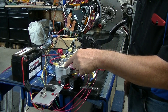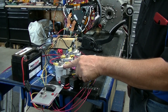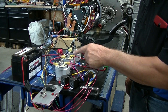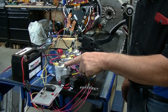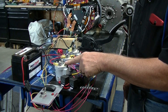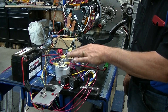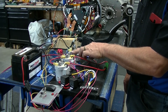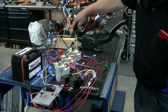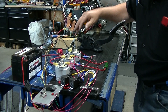Here's the setup. Three contactors. One contactor is a pre-charge contactor, which turns on before the main contactor and makes sure there's enough voltage in the system to run the motor so you don't hurt it. This is the pre-charge, this is the main contactor for the positive, and this is the main contactor for the negative. Those go over here — positive and negative — with just small wires on them right now since it's just a bench test.